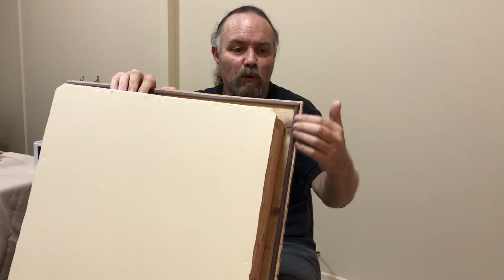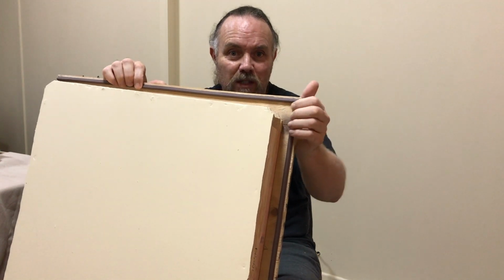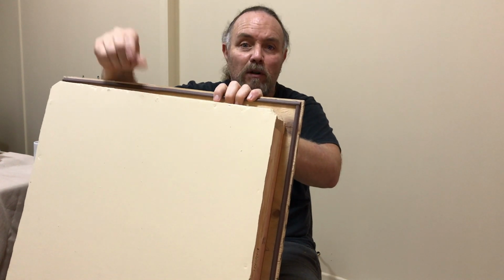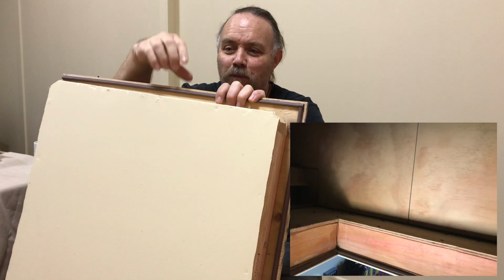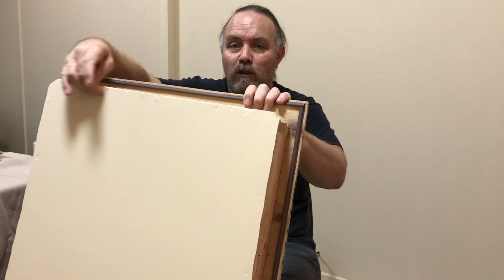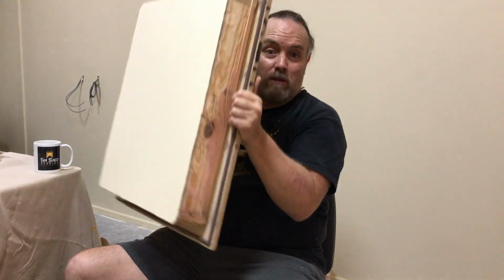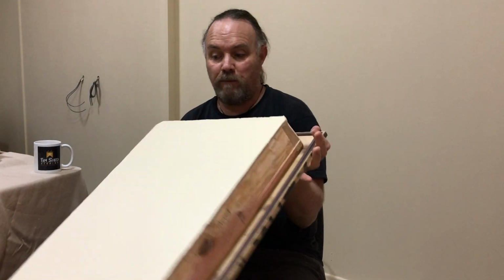And then at the moment I am putting on the seal. Now this is a soundproofing seal, and I will be putting it on the lip, and then there's a lip, and the two together should, when the weight of this, because it's not light, pushes down on it, actually seal the roof off. So I've got a double seal on this unit. One seal will sit on this section, which sits on top of the roof, and you can see through here it's quite thick and fairly heavy, so the weight should squash this down and seal it up nicely.